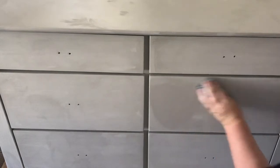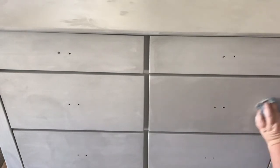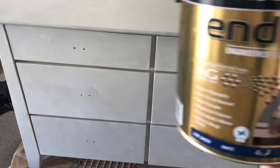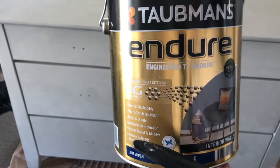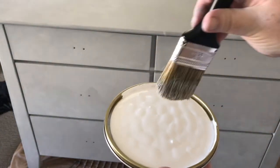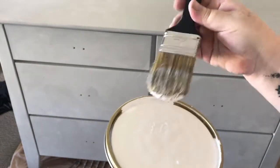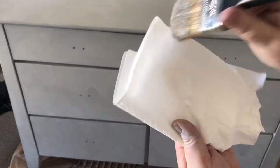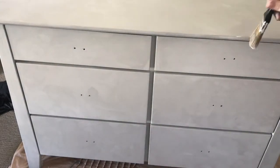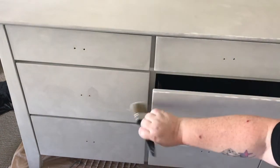So using the same dark grey Stormy Shadow colour paint that we had previously, we're doing another coat over the whole piece. Now once that's dry, I just use plain interior white, and what I'm doing here is a dry brush technique over the edges. So I dab my brush in just a tiny bit of paint from the lid, and I pretty much brush off all of that paint, so that I'm just left with the faintest little bit of paint left on the brush. And I do very light feather strokes all over the edges of the piece. So all over the drawers and down the edges. And you can see this technique demonstrated in my bedside table makeover, which will be in the link below.